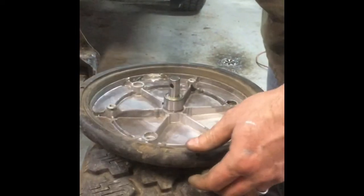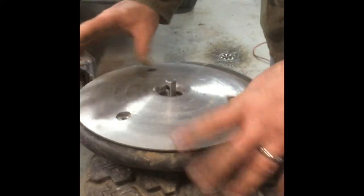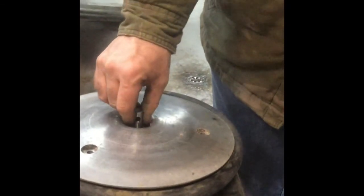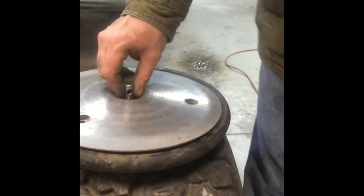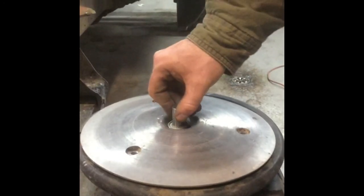That's all there is to it — put that together. If you've got to change the bearing or the tire, you've got to take these apart. Put your bolts back in with anti-seize. Drive that pin back on there, and also buy yourself a set of good roll pin punches — they're worth their weight in gold and they've got the right tools. Save yourself a lot of frustration.